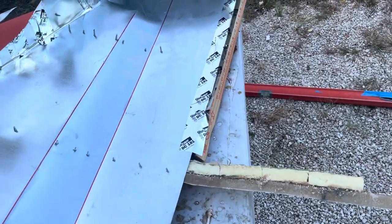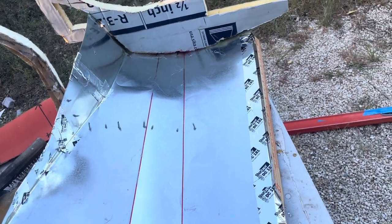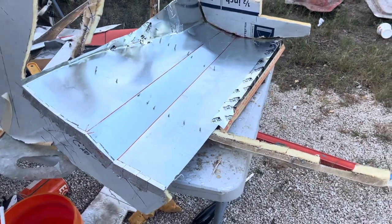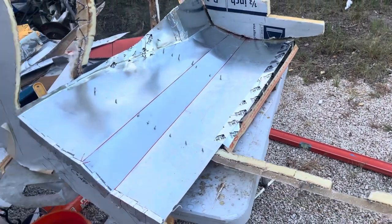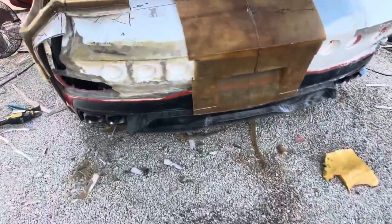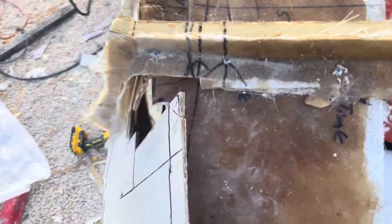This only works because it is relatively flat and straight linearly — if it weren't, it wouldn't work as well. I do have an English wheel, but I found out it's a lot more difficult to use than I thought, and in this case I just need it close enough to the right shape, so this will work without going through all the trouble of using an English wheel. So I'm going to coat this with gel coat and then put fiberglass mat on top of that — probably two layers of fiberglass mat, which should make it 90 thousandths of an inch thick. When I add the gel coat to that it's going to be that 100 thousandths of an inch thick that the other panels are, matching those old panels I made.